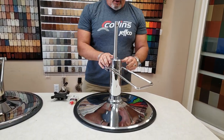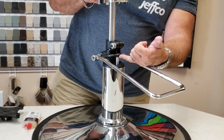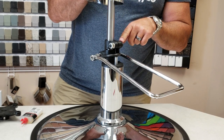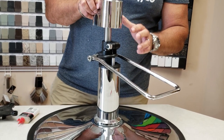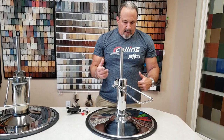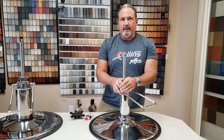Now for the G and K bases — they're slightly different on the inside than the other bases. You can see this is the adjustment point for the brake, this is the brake, and this is your yoke again — your lubrication point if you're developing a problem. If you just have noise when turning or letting the chair down, apply the 3-in-1 oil here at the top and let the chair back down. The K base brake assembly is slightly different, but we have a video that covers changing these cylinders out in more detail. This is a chrome base so it can be polished with chrome polish — remove the black ring first so you don't get white on it. That gives you a general idea of how to maintain your pump. Not a lot is required — just try these steps first before you call us. I'm Johnny Chaffin from Collins Manufacturing.